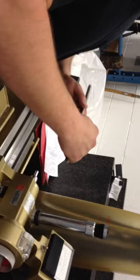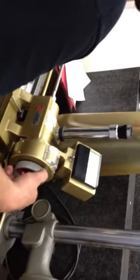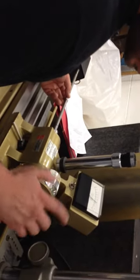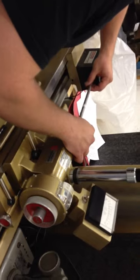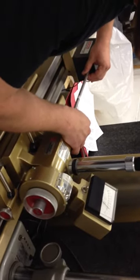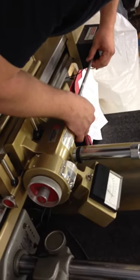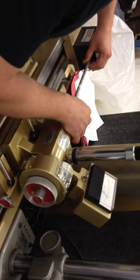We'll throw this thing on there. It's supposed to be 30 millionths. I'll take it to 12 right now. All right, so we're at 12 right now. We're showing 2/10 over. That could be a 1/10 over. All right, we got 2/10 and 60 millionths